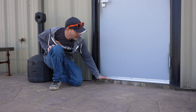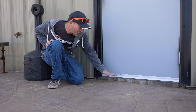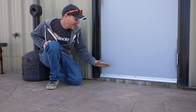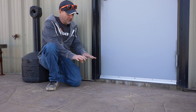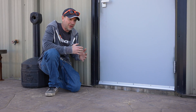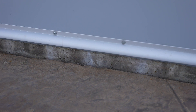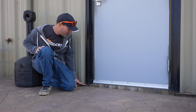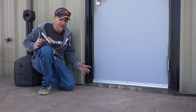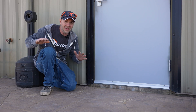This is the situation where I was talking about not tying into a foundation. We've got this nice solid piece of concrete here — yes, we could drill holes into that and tie this together, but if we had done that this would all be cracked up. We'd probably have some spots busted off where this concrete I'm standing on tries to come up, the dowels hold it back, and something is going to have to give. In this case we have expansion joint here — we actually have this built out with foam so it can come up past this little channel. In the winter this slab comes all the way up to this channel, and right now in springtime it's already settled back down. Tying these together would not be a good idea at all.